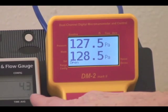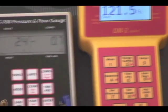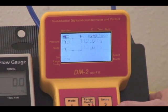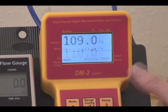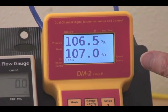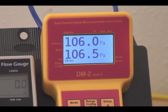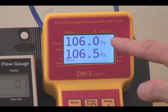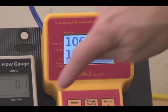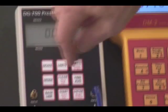This one has dropped all the way to the end, so we can say this check is complete. The check can be frozen by turning the AutoZero off — with AutoZero off, it will stay more or less frozen at one pressure and sit there for quite some time, which tells us the gauge is not leaking. We're only off about half a Pascal, less than half of 1%. We've been able to check the gauges on the positive side of channel A and positive channel B.